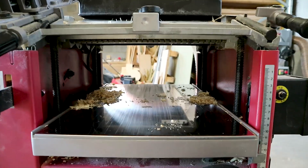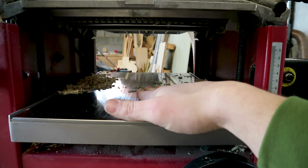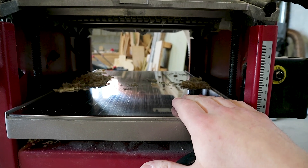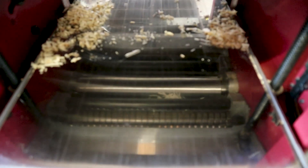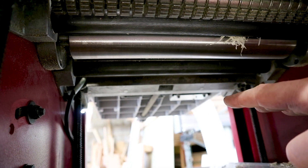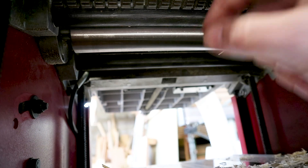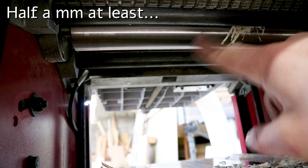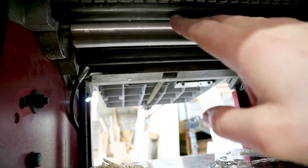A couple of things are going to cause issues if your planer isn't feeding correctly. First, you're going to get a build-up of resin and general muck on the table. So the first thing we did was get some acetone, cleaned the table off with it, then got some machine wax on there, waxed it down with plenty of wax, let it dry, and buffed it off — nice and shiny. Second thing to check when you've got a planer with steel feed rollers: are they clean? Make sure it's unplugged and fully isolated before you do anything. You can see the serrations on the feed rollers — they're maybe a quarter of a millimetre deep, so real easy to get gummed up with resin, same as the table. So we took some acetone, cleaned them, rotated them, cleaned them, rotated them — cleaned both feed rollers thoroughly.